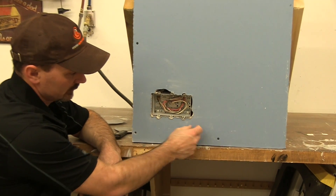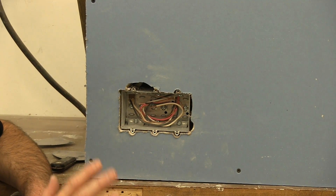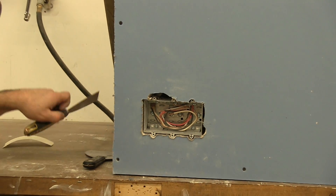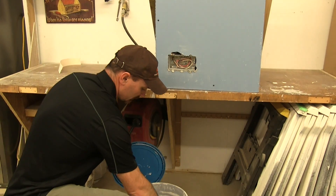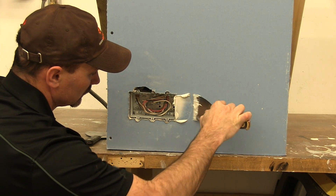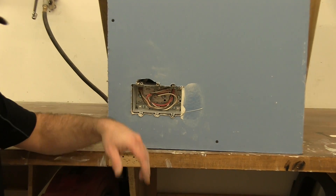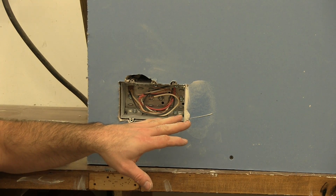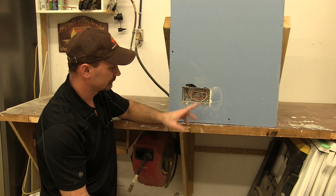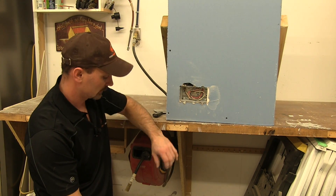One is pretty minor — in most cases your cover would likely cover this, but it's borderline. Something simple like that, generally all I would do is just take a little bit of drywall mud and just force it back into that gap to fill it in like so. When you do a thicker blob like that it's gonna shrink a fair bit, so on your next coats just remember to have a look at that and give it another little fill in. Then just sand it smooth when you're sanding.